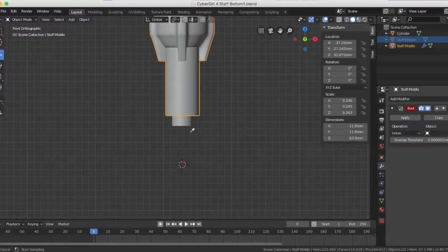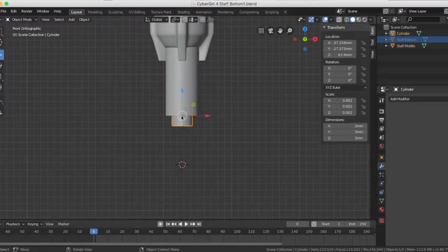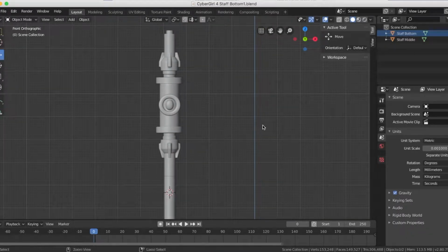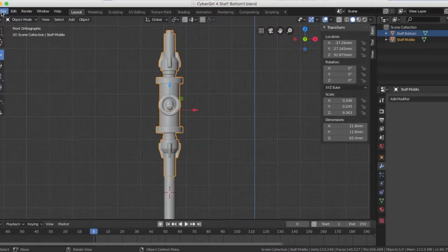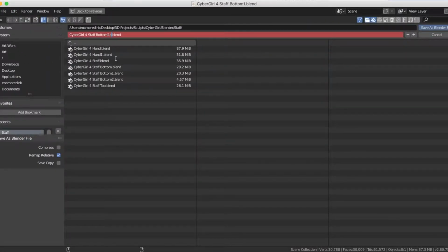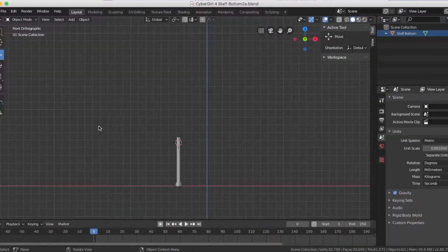And always experiment a little with your setup, because 0.15 of a millimeter might be too much or too little on your setup, depending upon your temperatures and your filament and the temperature in your house. All of these variables can change on the expansion and shrink rates of your plastic. So do tests. Make sure it works for you.